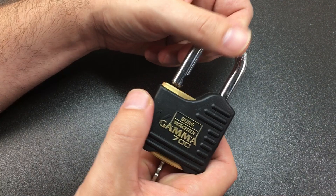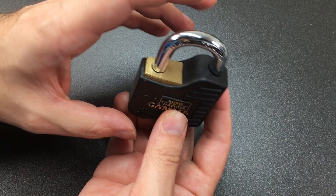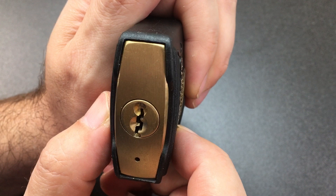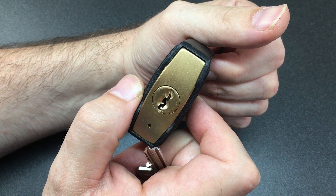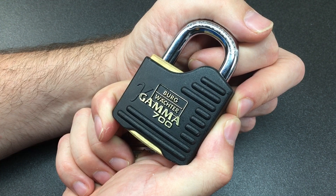This lock is a surprisingly good lock — or rather, it's more surprising how good it is. The ball bearing mechanism, and it's a nice thick brass lock with a nice 10mm shackle on it. The keyway is extremely paracentric, and for this type of lock it does have spool pins, but it also has spool keypins. The keypins are spooled, which is really strange. I don't know of many padlocks with spool keypins, and if you get into an overset situation, that's it — end of story. The tolerances in this lock are fantastic, and the spool pins are really thin.